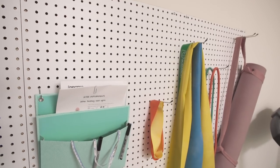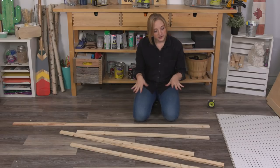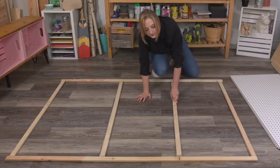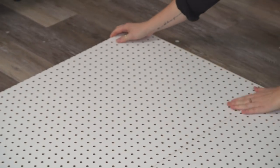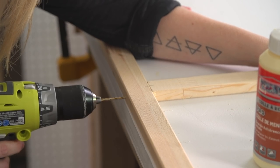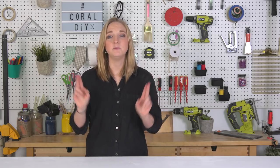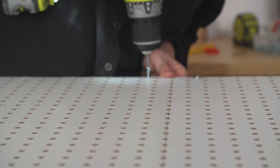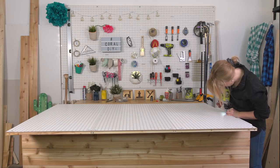I love a good pegboard. It is great for organizing and keeping things open and easy to grab. I'm creating a frame using 1x2 lumber, and I've already pre-cut these pieces down. If all is correct, you should be able to properly lay three pegboard sheets at 23.5x48 on top. To attach all my 1x2 pieces of lumber together, I'm pre-drilling two holes at each joint, and I'm securing it with some wood glue and two 2-inch wood screws. By pre-drilling, you're making sure that you don't split those 1x2 pieces of lumber. We now have a frame! Add your pegboards on top and secure to frame with a 5/8 wood screw and a half-inch washer on each corner. The 5/8 wood screw has a dome head on it.